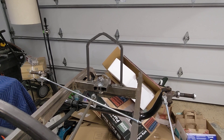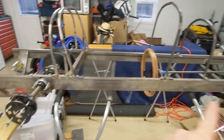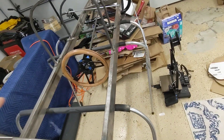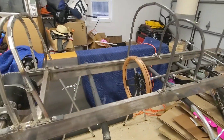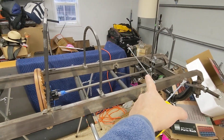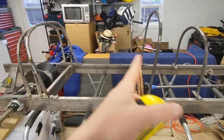It's a classic mistake a lot of people make — they're trying to copy the shape, but it's a caricature, not a scale model. I say this over and over again: you can scale the wheelbase, you can scale the body lengthwise, but when you scale it widthwise, you start off with a two-person car, scale it down to one — that's fine. But you can't scale your legs or your arms down.